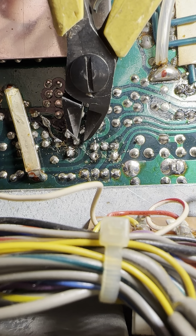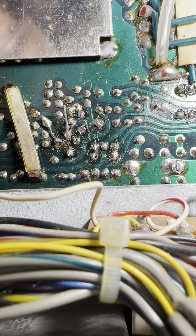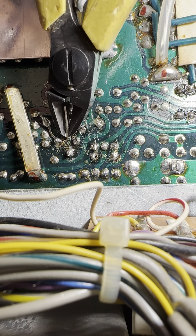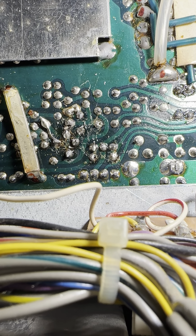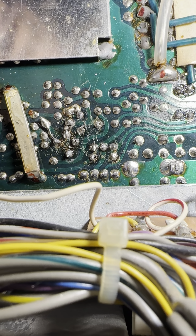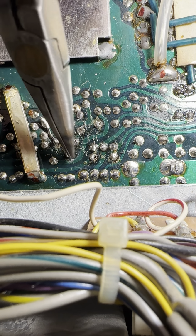I'm confident that the transistors are correct in the sockets, so I'm not worried about that. Drain is drain, gate is gate, all that's good. This connection gives me a little bit of worry because I screwed that one up, overheating it. Okay, now it's time to look for mistakes and slop and solder that's splattered around. Make sure this thing has integrity. Of course, it's not going to be new like it was, is it?